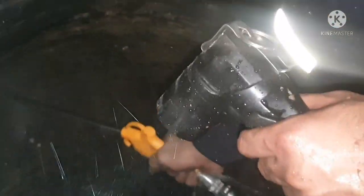Whenever you do the seawater filter cleaning, it is better to clean this pipeline also. So you can see this is the valve. This is the valve that is already closed, but you can see the marine growth over the valve. So again you need to scrape down that marine growth using your scraper. And yeah, you can see we have almost removed everything, and you just need to blow water and ensure all the marine growth is cleaned. You can see when you are flushing with water, all this marine growth is falling down. So this is how you have to clean the marine growth inside the seawater pipe.